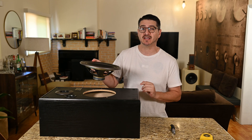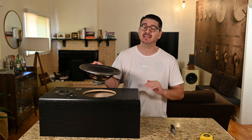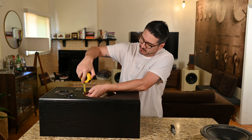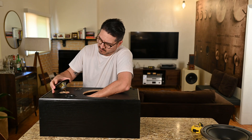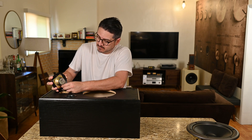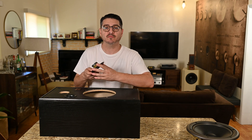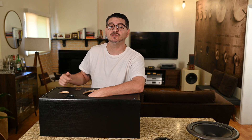We just won't want to push this past about 90 dB, but in the 75 to 85 dB range it should sound pretty good. The cabinet is made out of half-inch particle board. The tweeter has black and yellow wires, the yellow going to the plus, and this tweeter is 8 ohms — the same as the woofer.